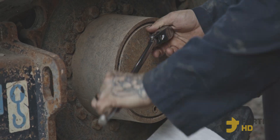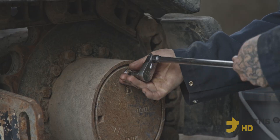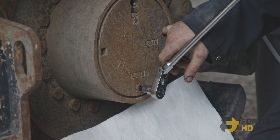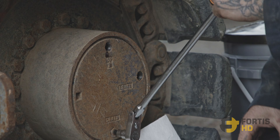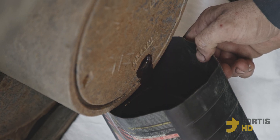These can sometimes have a little bit of pressure in them. Take off the top one here. It's low — it's a little dark. You can have that gear oil smell to it. We highly recommend you sample your final drive oil at the time of service.